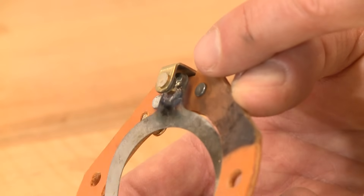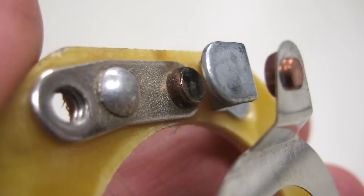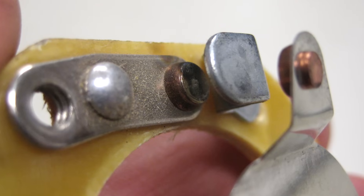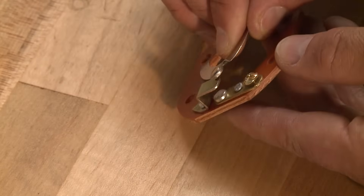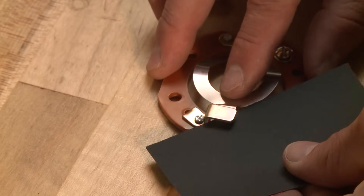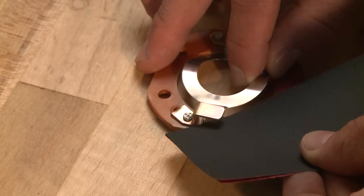If the points are welded shut, then the contact plate must be replaced. Over time, the points on the contact plate can develop a blackish carbon buildup due to the capacitor discharge during the startup phase — this is normal and will not affect startup. Look closely at the surface of the points for signs of pitting. Light pitting can be gently sanded smooth with some 400 grit sandpaper, but larger deformities on the surface of the points will cause an unusable condition and potential arcing. If excessive pitting is detected, the contact plate should be replaced.